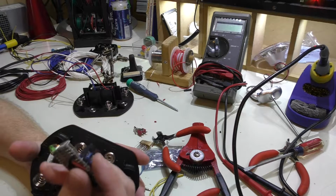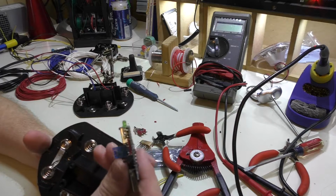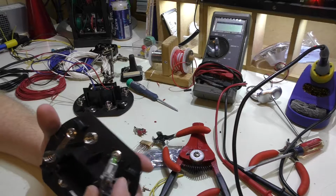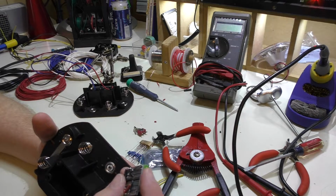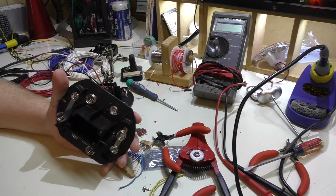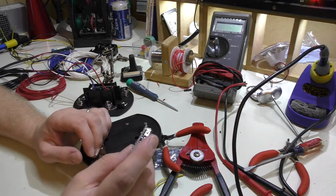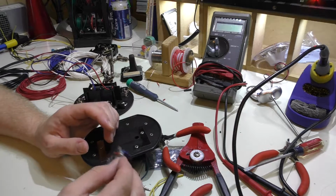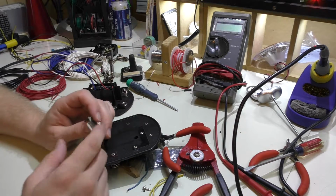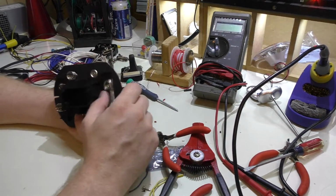The only thing is it has that terminal block that I put in there. You can see it sticks out of the board a little bit. So if I want to use this, I can just desolder that and put this through, and I just have to mark out where this is going to hit and where that LED is going to hit, and that'll pop out, and then that way it'll also indicate when this is working. And I can also solder the wires directly to this board and then just use it for that. And then that way when I build my second, better edition, I already have a basis to start off of, and this already went to good use. So I might do that.